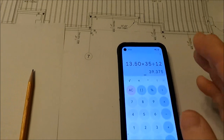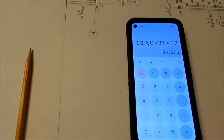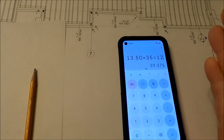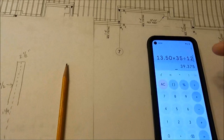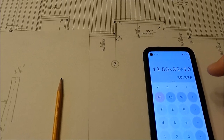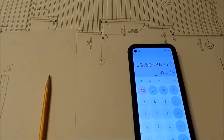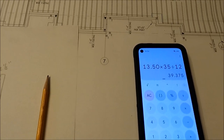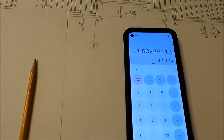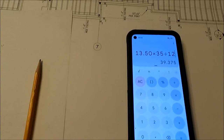which is good because every time I cut a block, I'm going to lose a little bit of length. So if I order a 40 footer, that'll give me plenty for making those cuts. So I'll be able to get 35 blocks out of a 40 footer I-joist, and I need 130 total blocks. So if I get four of those I-joists at 40 foot long, I'll have plenty, and I'll actually have some left over.